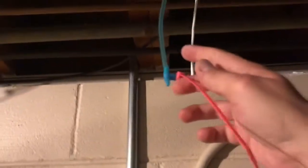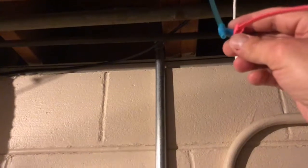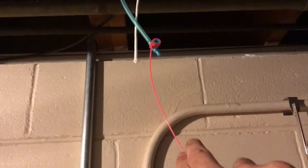You'll notice on top of each one of the valves, there's a zip tie. Now, I don't know about you, but turning these on and off with that little itty bitty screw that they put in here, royally painful. You add a zip tie to it, snip that, now all of a sudden you can turn these with no problem whatsoever, adjust your airflow, get it dialed in, you're good to go. What, 8 cents for a zip tie? Makes it so much easier.